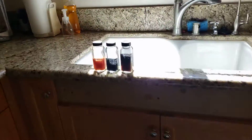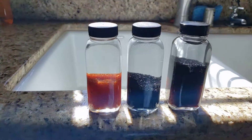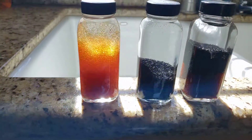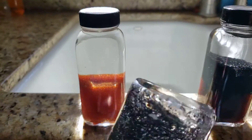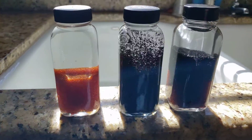So if we look at some of the medias — walking inside my break room here — these are the medias we're talking about. This is resin. This is what softens the water. As you can see, the resin is really light and flowy. This is carbon. Carbon is what removes or reduces chemicals like chlorine, depending on the application.